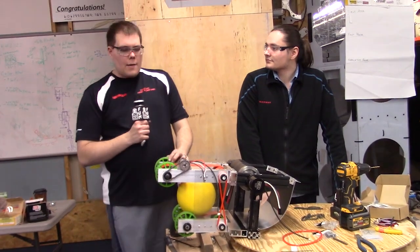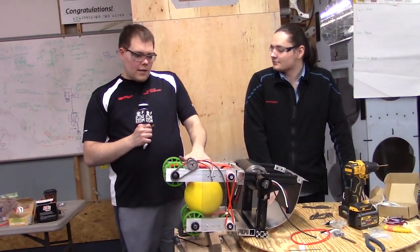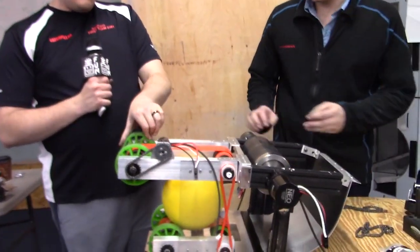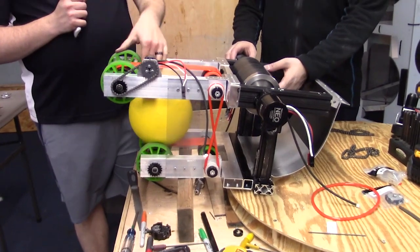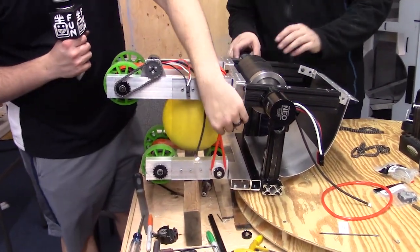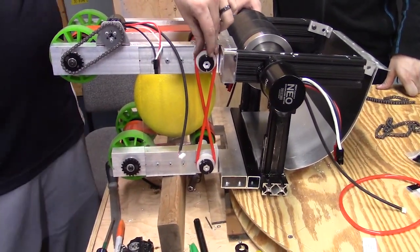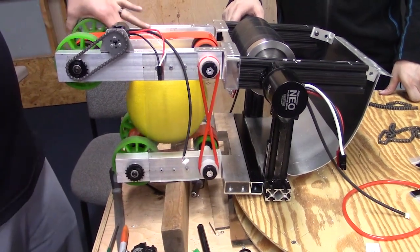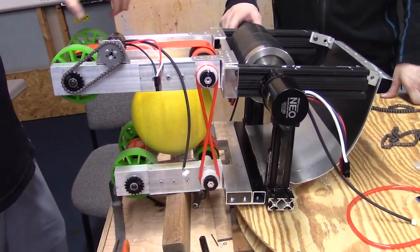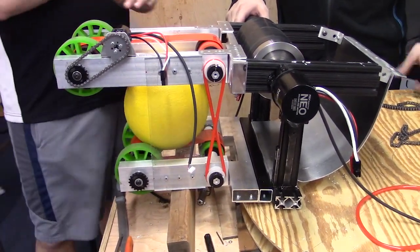Hey, Ben here with FIRST Capital RI3D. So we've got an assembled kick-up elevator right here — a short elevator run that we use to move the ball into the shooter. Right here you can see we've used our polychord infinity belt. Basically, it's welded polychord set up so that one side makes the other side move at the same rate through a belt. It works pretty effectively, and a lot of teams have used them before.